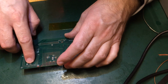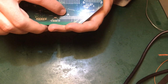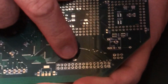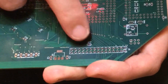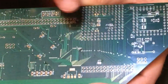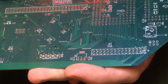There's a few jumpers here as well, connected jumpers. These are for optional changes. So for example down here, jumper 7, this connects the CPU bus grant in, CPU bus grant out lines. This is where the jumper on your Falcon is normally shorted across, and I have it normally shorted because I rely on the lower priority bus grant pin from up here. However, you may wish to stack a board on top of this if that's your want, and you perhaps need to interrupt that. So you've got the option to snip that.